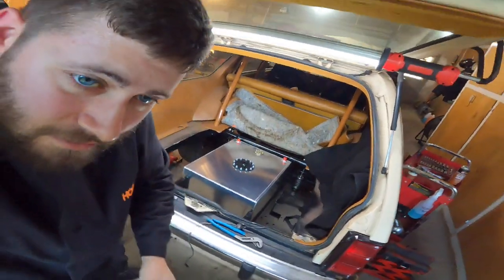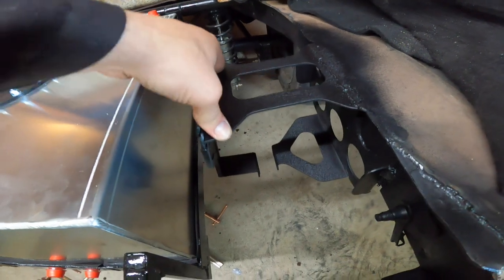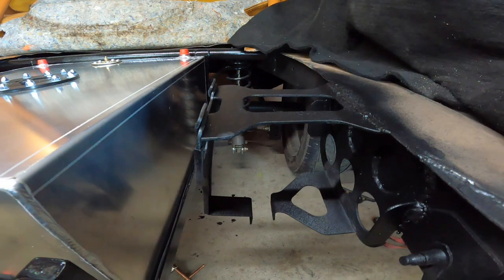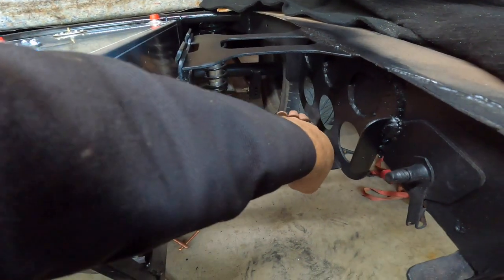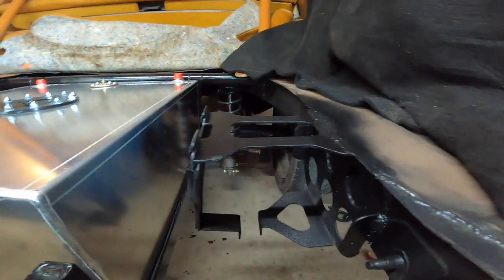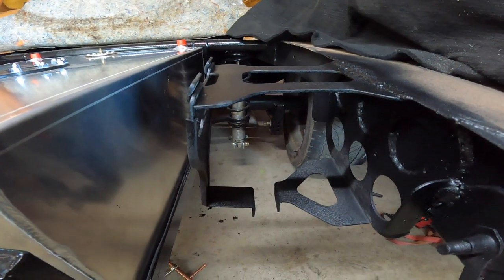By the by, I got my battery box in there. Now I do have a slight concern. She's a little squishy that way, and a little squishy that way, but my thought is that the majority of the weight of the battery is going to be on the shear force of this plate. And I welded each of those little things, welded up top, welded on the back side. So maybe not worry about it falling out. Once it's cinched up, maybe put some spacers in there.